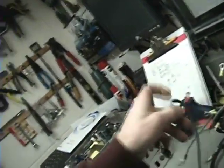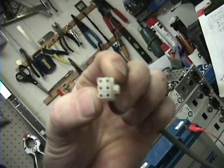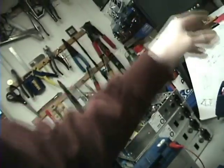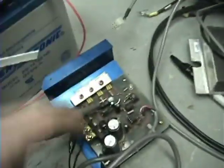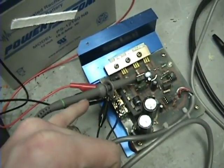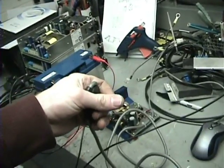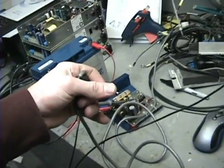What I have to do is give this plug the right signals — it needs a ground, a digital ground, and a pulse width modulated signal. So I'm going to be building my own pulse width modulator, which I've already done before. I actually built an electric skateboard and this is the driver I built for it. It basically does what this does — there are three MOSFETs on here. I can hook up 24 volts to the circuitry and 24 volts to the motor.